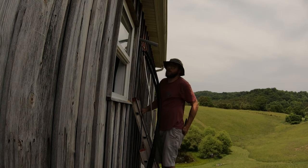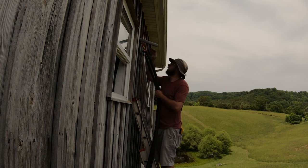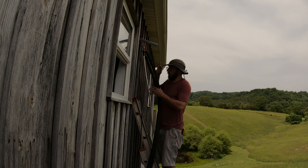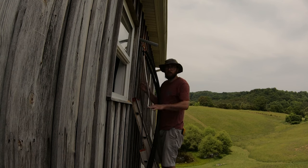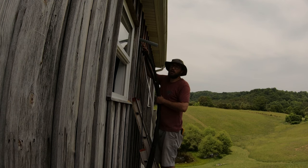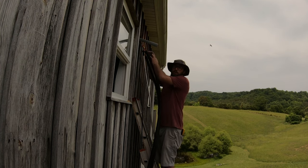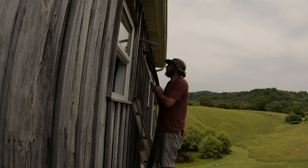Okay, so I've got those pretty much where I think they need to be, but since I'm not using my nice precision tools that I used to use, I'm gonna leave this untaped here and just kind of loosely place this down. And then we'll kind of get it roughly where it needs to go, everything kind of roughed in more or less. Get the bottom attached, run the vacuum, make sure it holds, and then we'll come back and tape everything up. Because if for some reason my flare wasn't good, or I'm not quite tight enough as I think I need to be, then I can come up here and adjust, fix, whatever, without having to undo all the mess of tape that I'm gonna end up putting on this.